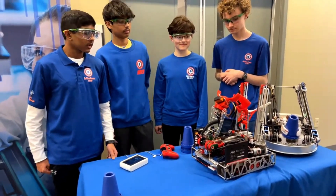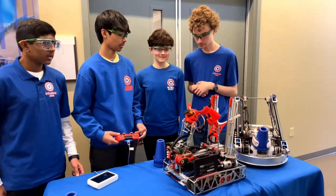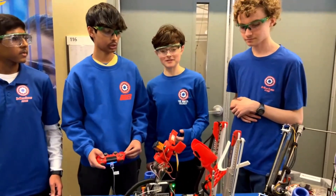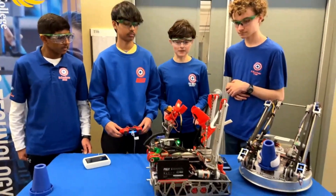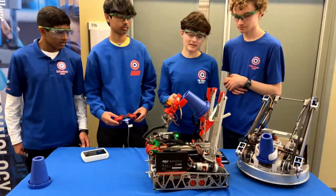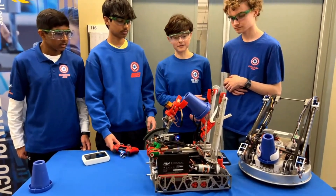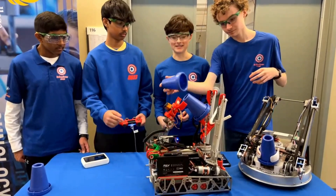Jumping into your deposit — walk us through the hardware and the transfer process, which is one of the most difficult things for teams. We worked really hard to make the transfer fast. One thing we found absolutely essential was running slow-motion video tests. We'd set up the robot and watch exactly where the cone was going relative to the deposit when it wasn't working. A lot of times our claw timing was off — it would wait too long so the arm would bounce and the cone would come off, or it would open too early and throw the cone past the deposit. We had to get that timing exactly right.